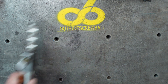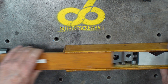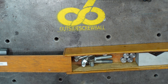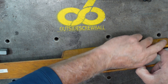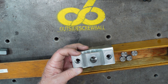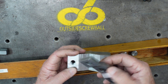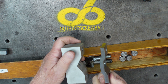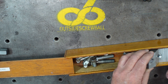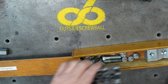This project — a center drill jig. This was something I found on the web and copied. Basically you make your bushings; I've got extra bushings in there. You have the V-block and then the top piece, and when this is in place and you put a bushing in it, it's going to drill center. It can go this way or it can go this way — two directions — so you can hold a fairly large round in it. Another really fun project to build, and I've used it for center drilling.